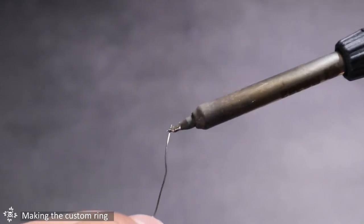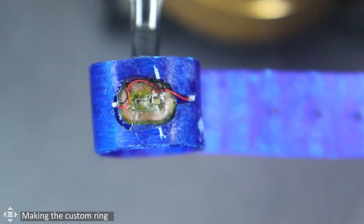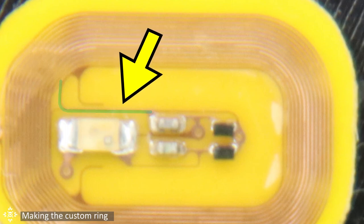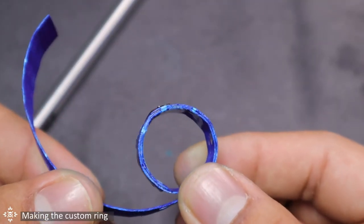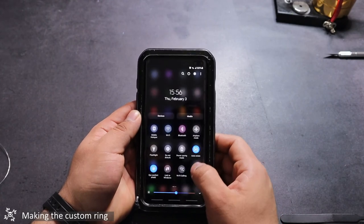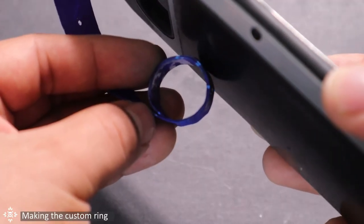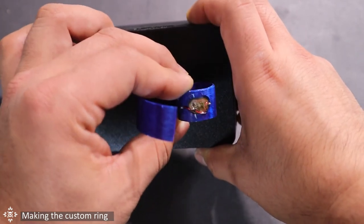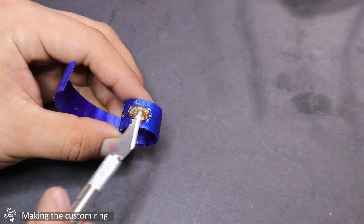It happened to me very often. Once the positive terminal is done, start with the negative terminal. Make sure that you run the wires on the same side as the wires for the positive terminal — otherwise you run the risk of shorting it with the tiny wire. Make sure the wires are flat and that there are no big blobs of solder that protrude too far out from the slot of the tag. To make sure everything is working perfectly, you need an NFC reader to turn the tag on. If you have a newer smartphone, it might already come with NFC integration — turn it on and place your phone close to the tag. The LEDs should turn on. Now that we know it works, start applying glue to the wires so that they are completely flat, and add more glue to the tag and LEDs to further secure them.